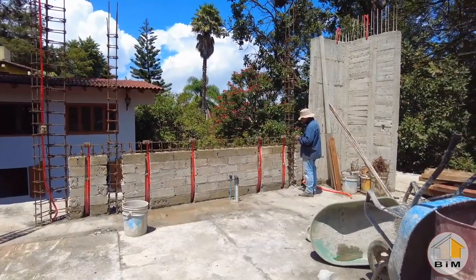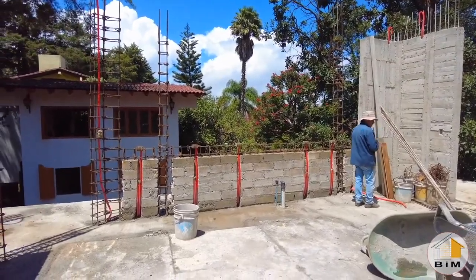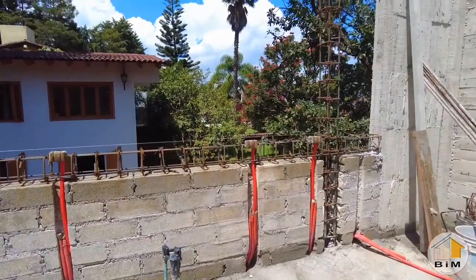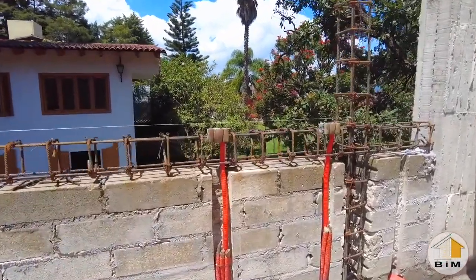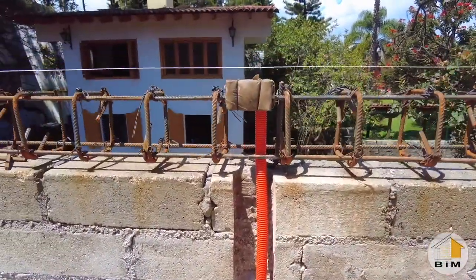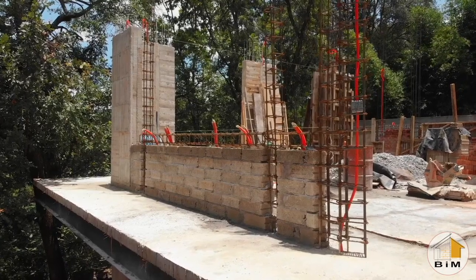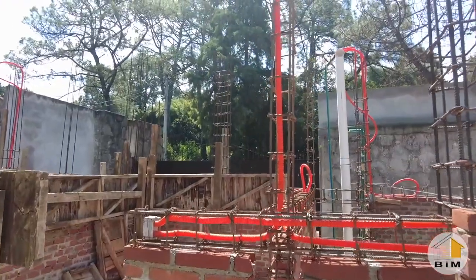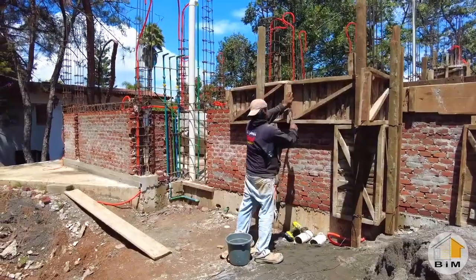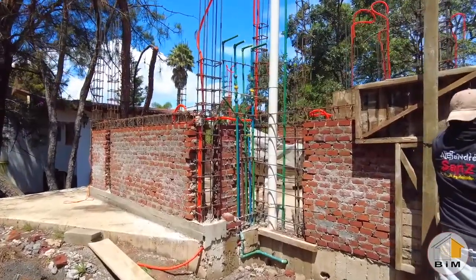Once the half walls are in place, our electrician Fair will cut channels into the block or brick to lay in his manguera, the hose for the electrical wiring. He'll mount the electrical boxes on the rebar and stuff them with wet paper to protect them during the concrete pour and make them easy to find. And that electrical hose runs inside the concrete pour and exits up the castillos to the next floor, directed wherever it needs to go. The same has to be done with the plumbing.